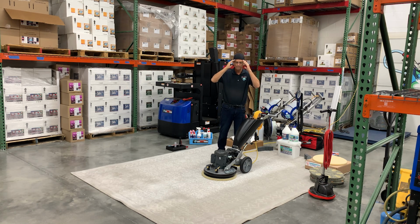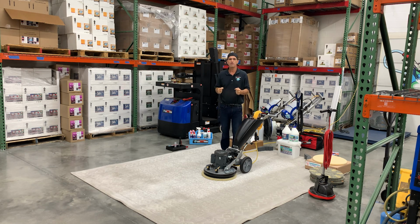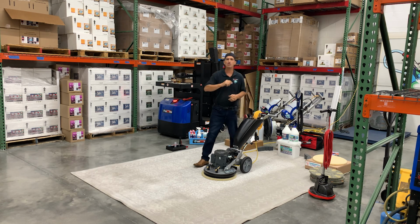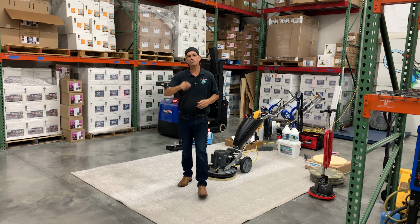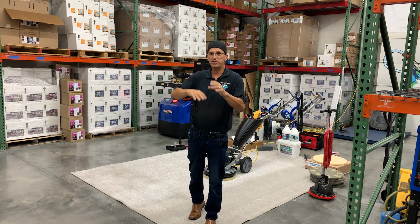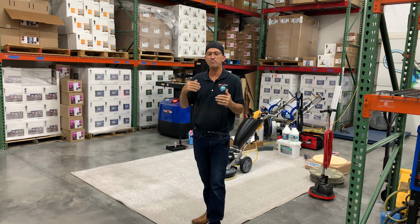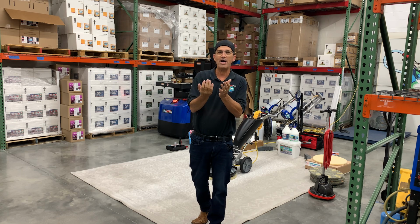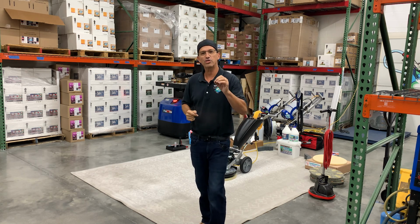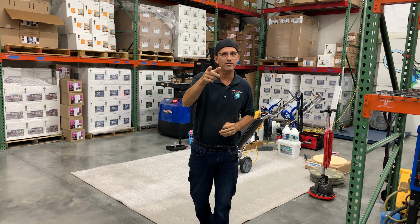What separates Orbot from other companies? Number one is performance. Okay? Now, I know a lot of guys say, well, these new machines, they're heavier and they turn faster. You can move faster. It's got a longer throw. Well, however, guess what that longer throw does? Guess what that higher speed does? Guess what that heavier weight does? Okay? Why do you think it's not approved by a lot of carpet mills? Because there are so many different variables, and what happens is you end up tip blooming the fibers. So yeah, the carpet looks great at first because the polymers fill in all the scratches and stuff like that, or where you've unwound it, but guess what? It uglies out fast. So the carpets look good at first, and you think you made this great progress. So does the customer too. She doesn't know the difference, but you should know the difference because you're a professional.